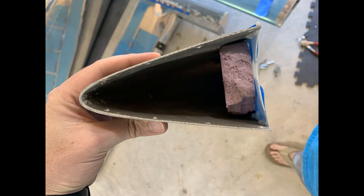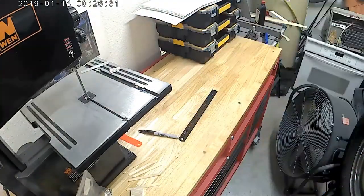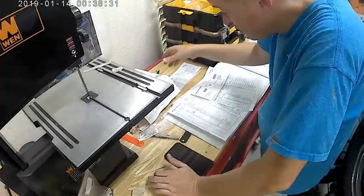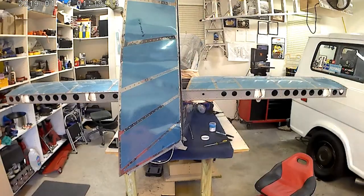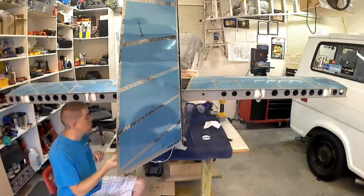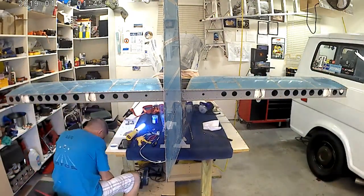Here's a foam plug that I put in to make sure it stayed at the correct angle, and then I used a vice to make that bend. This is the final product of the horizontal stabilizer to the elevator arm — I'm pretty happy with the way those came out. My rudder — they say there needs to be one eighth inch; mine was more or less three sixteenths. I found that taking a rod end bearing and doing half a turn and retightening the jam nut got me to the one eighth I needed.